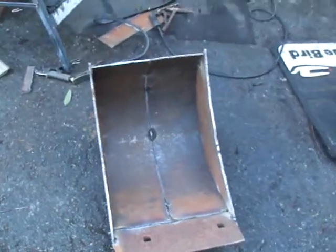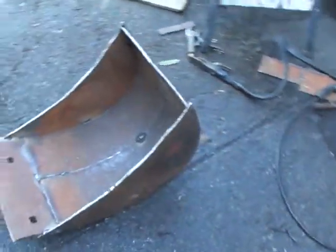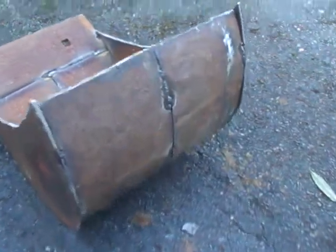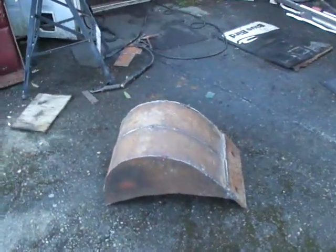Two side-cutting edges will also be installed. This is the first stage of this rough service bucket. The next stage is going to be adding some reinforcement — could be angle iron or some sort of plate. Then there will be six strips — they call them wear-and-tear strips — to reinforce this 3/16-inch bucket plate and at the same time provide a lot more wear resistance.